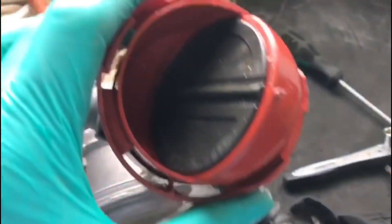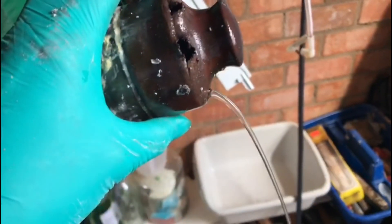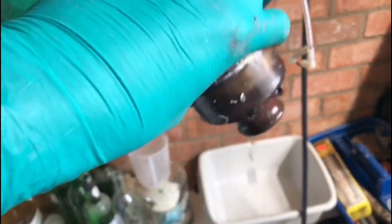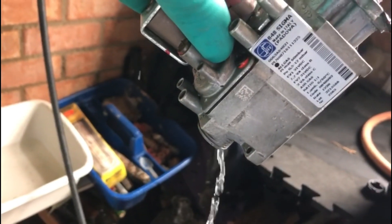This first video is from Paul. This is the fan — the part that goes on top of the heat exchanger — and you can see it's full of water. That's the actual gas pipe, also full of water. This is one of the baffles and again full of water. This is the gas side, so there should be no water in this part — it's not a water-carrying part — and this is the gas valve. Obviously gas and water do not mix, so that's water in the gas valve.